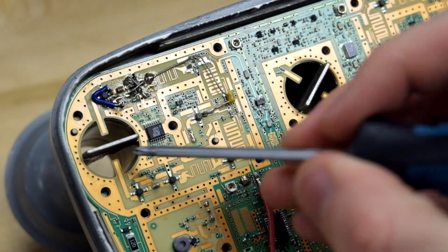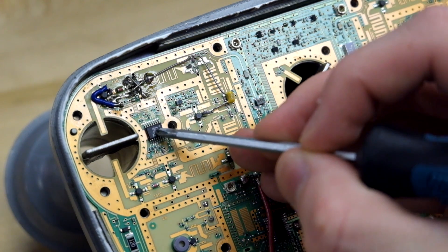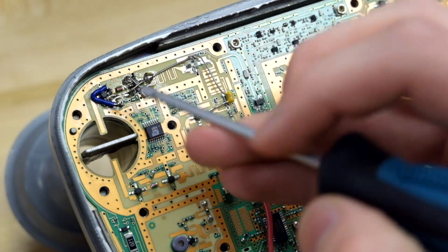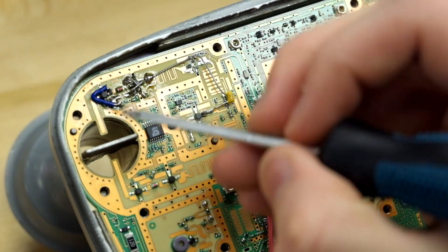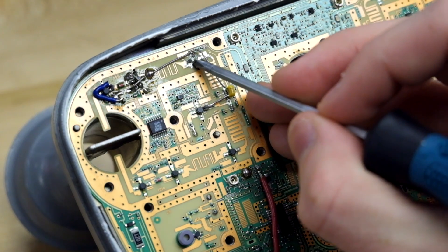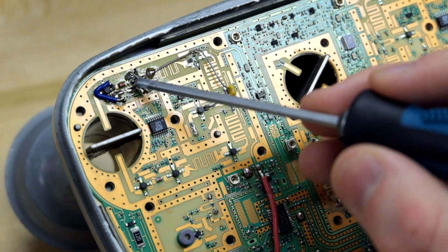This is the unmodified receiving side. There's a transistor, some filtering — bandpass filtering — so this is just amplification, and then it's coming out right here, which is where I'm measuring. This chip is responsible for biasing the transistors — they're not bipolar, they're more CMOS; these are RF-specialized FETs and I'm not exactly sure what kind. There are two FETs, one here and one here, that I took off using a rework station and flipped them. Then I had to figure out what traces to cut and swap around the biasing circuitry. There's also a third transistor here that is not necessary and should be removed, because that's the final amplification stage before mixing — but this channel is not supposed to be mixed. So instead, we're connecting right to that transistor from the local oscillator.